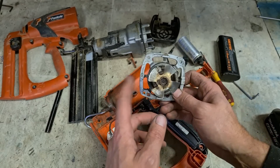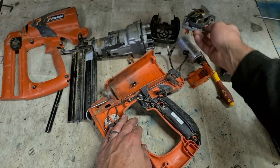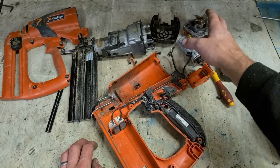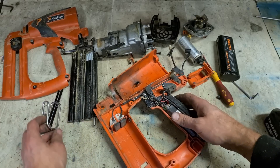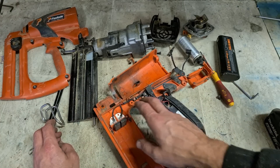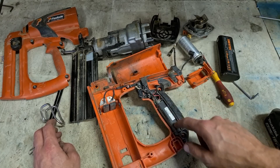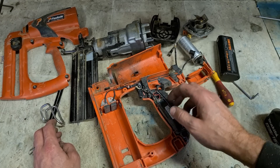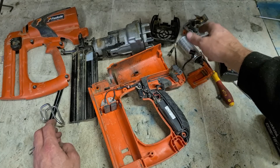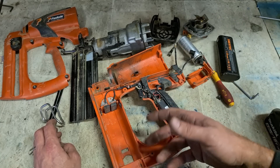Can't be the motor either because it doesn't start the motor until you plunge it — so that's not going to give you a false reading. Plus, if the motor is bad it'll only give you a red light if there's a bad motor. That clearly works. The red light is on but it still works. The other thing it's going to be is the spark unit. It can get faulty sometimes where it only puts half the current in for the motor. Electronics in this can give a wee bit of trouble sometimes.